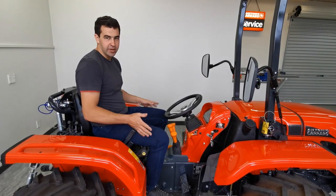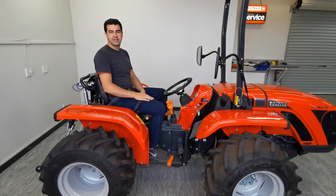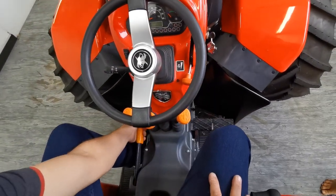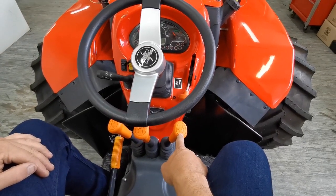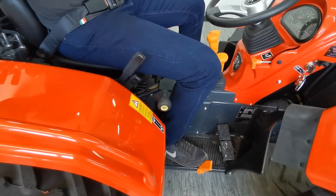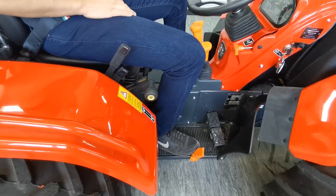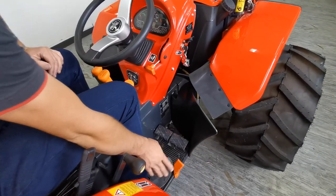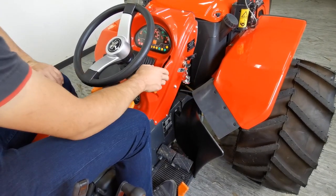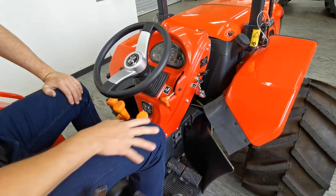To start the TN 5800, we've got a few safety lockouts. Once you're in the seat, put your seatbelt on and make sure it's adjusted. There's a safety seat switch, so you need your bum firmly in the seat. Your foot must be on the clutch, the handbrake on, and your forward and reverse synchro shuttle in neutral — you'll feel the detents, and the middle is where you want to be. Make sure the PTO lever is all the way out, the foot throttle is off, and the hand throttle is back to idle. Then turn the key on, you'll see the glow light — give it about three seconds — then simply crank the tractor over.